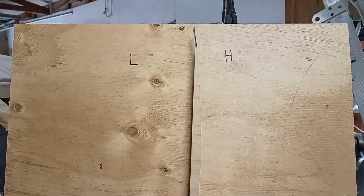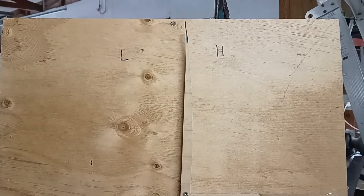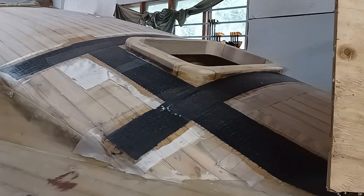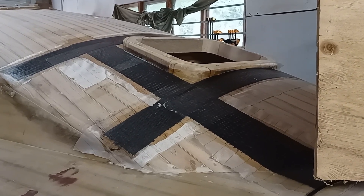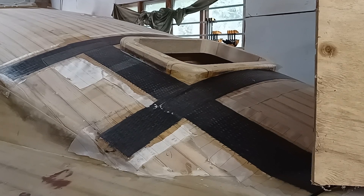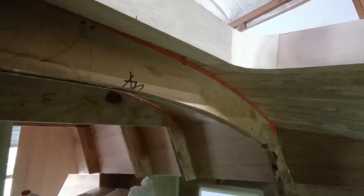So I'm giving it a bit of hot air while the resin cures so that it all sets in the right place. It's the next morning and my humidity tester is pretty much back to where it was when I first set it up, which is of no surprise — it's quite a humid, overcast day, not much sun. My decision to do this for strengthening the deck looks like it's going well. I'll take the supports out underneath the temporary deck beams — it's not going to be stiff yet because I haven't got the bands underneath the deck, and I'm not sure if I'll do them in carbon fiber or fiberglass uni. You can see after the carbon fiber uni has been put on above this temporary deck beam, there's no gap — so that's really good. It's stabilized the deck as you'd expect.